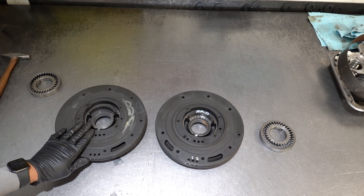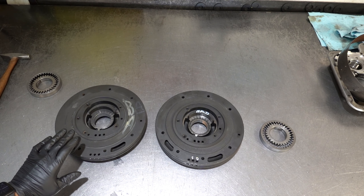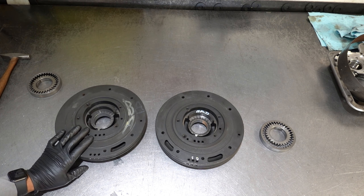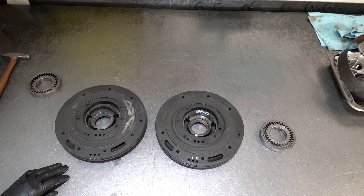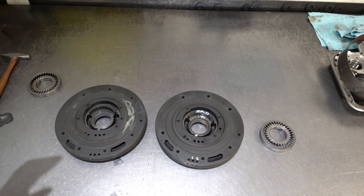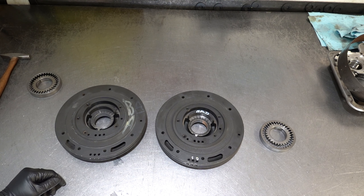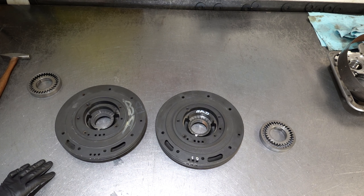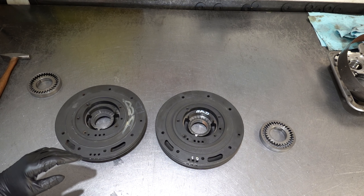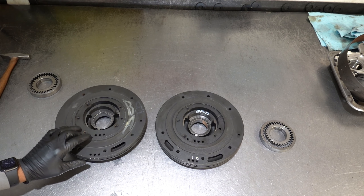When you have wear in the priming crescent area, especially on the ends and particularly on the drive gear-facing side, you will not have anywhere near optimal pressure. Depending on severity, you may have a pump that barely functions — giving good line pressure readings only at idle, but way below spec at stall. You won't have sufficient volumetric fluid flow for line rise in the apply circuits, and as a result all your clutch packs will burn.